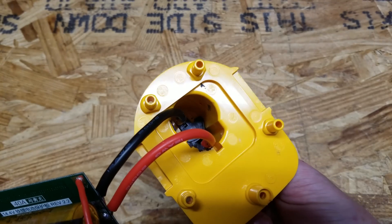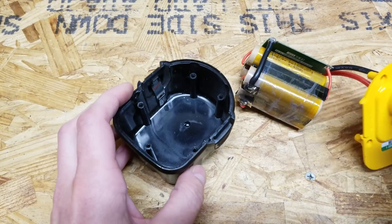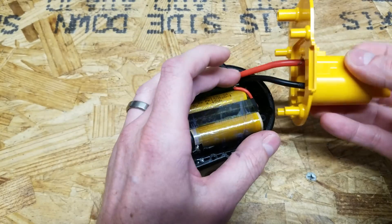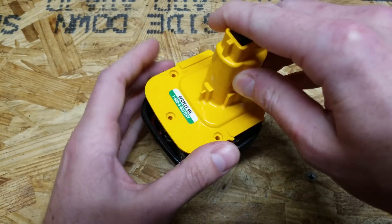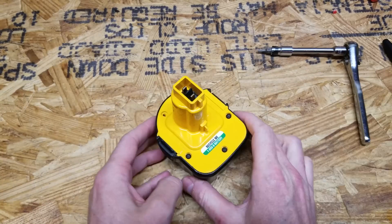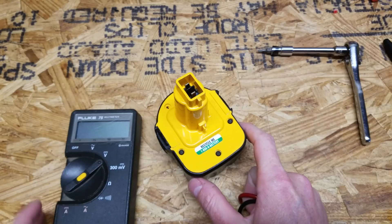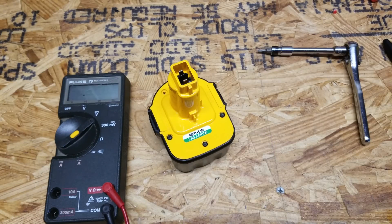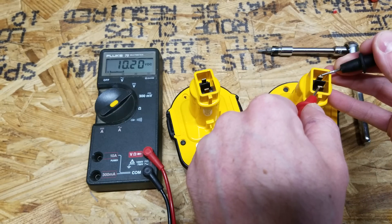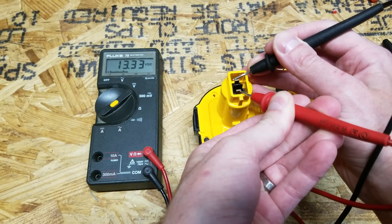It's been two days since the epoxy was set — it should be hardened up and good to go. I'll put our battery in the case and the lid fits on nicely, so I'll put the screws back in. Before trying it in the drill I just want to double check that I have voltage and the polarities are correct. The battery on the right is the old NiCAD and the one on the left is the replacement. On the older battery the lower terminal is positive, and that's correct on the new battery as well — you can see it's reading 13.3 volts.